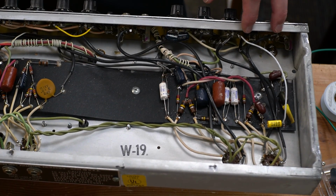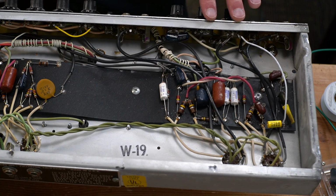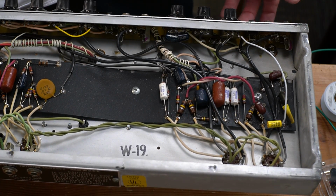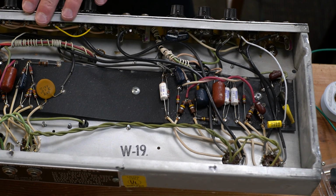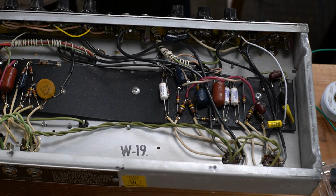So, we've basically taken the tone stack out of this side. And I want to see if that really will boost the gain, give it maybe more of a Tweedish feel. Might be something kind of fun to play with. You kind of got a Blackface side and a Tweed side, basically. And again, this side is just running wide open. There's no real filtering, no trimming of frequencies. It's just wide open. So I want to try that.